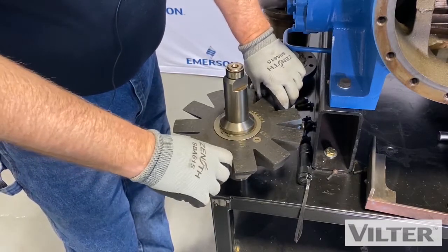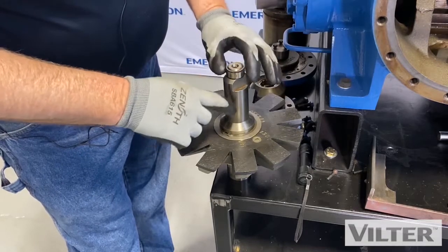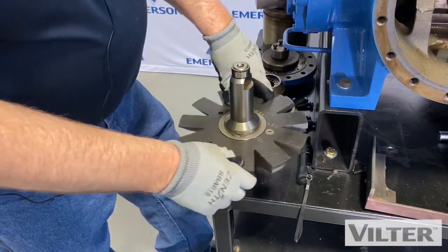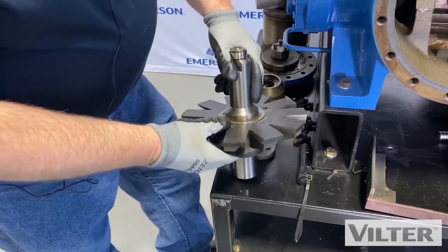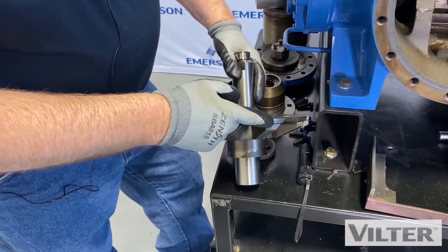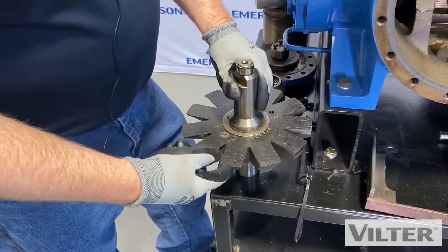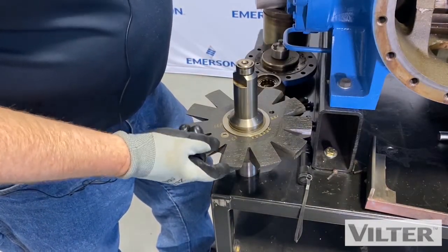This is that bushing I was talking about — you can see how it moves. With the blade out now, we can check: do we have any damage? We don't see any damage on these blades — no chipped leading edge. So this blade is in good shape. On the end, if you can see it, there's a little bit of a step, and that's normal. If that step is still there, we don't have bearing wear. But if that step has disappeared, that means this rotor is moving around too much and touching the end of the blade against the inside of the groove — it's bottoming out and showing wear there on the end. So that step being present is normal.